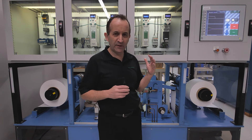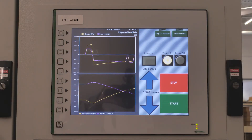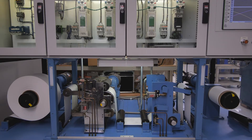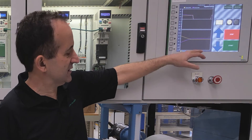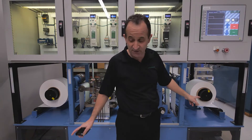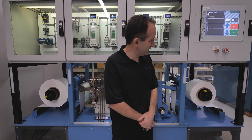So right now I'm going to start the machine up. As this is an inspection machine, when the roll is fully unwound at one end, the machine will stop and auto reverse. This nice display here is showing both the diameter buildup that we calculate and also the line speed. So when the diameters are equally matched, they'll be running at the same motor speeds.